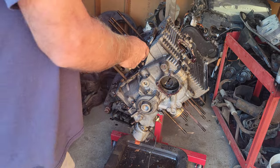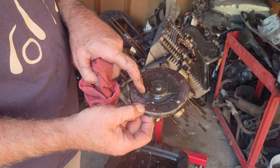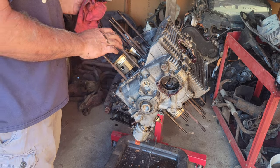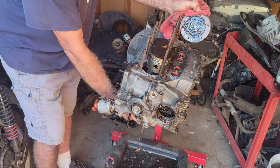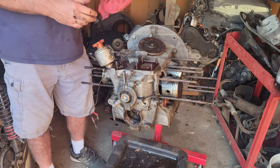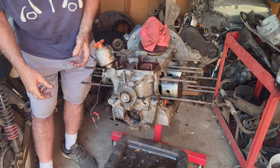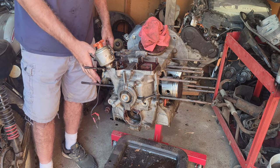All right, so here's what I found so far. Of course, there are rod bearings all through here, or mains, I don't know. Obviously an oiling issue somehow. We put this one together with a 20 millimeter pump, which probably should have been a 26, but 40 horses came with 20s. We never planned on putting it into this truck, so it wasn't really built for this.